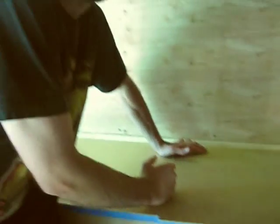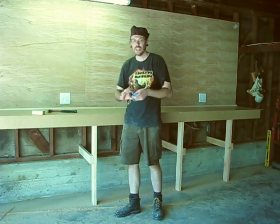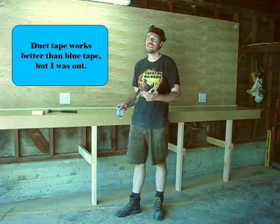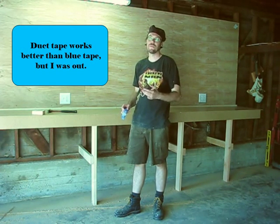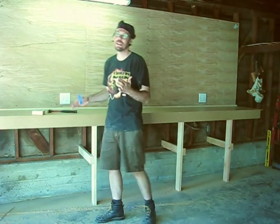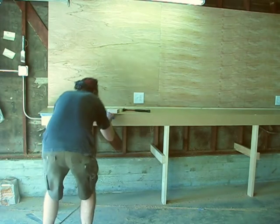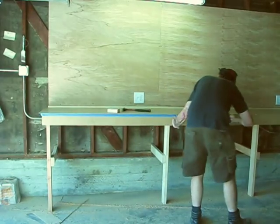Not perfect. If this had been laminate for a kitchen countertop, we would have used a block plane and a sanding block, scribed everything in and made it really watertight. As it is, this is pretty good. You can always squirt a little silicone in the big gaps — probably won't bother. So now you just take the hammer and block and pressure it down again, then trim the edge just like you did the front. One thing you want to do is run tape right along the edge, because sometimes the router bearings seize up — out of oil — and if you don't have tape, it will leave a big black scorch mark on your front splash. For countertops, that's something you always want to do. Run a line of tape along the top of the backsplash that your router bearing can run against.